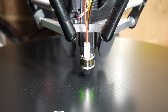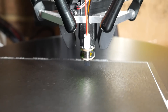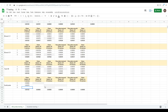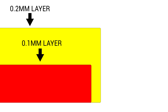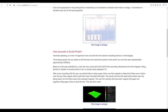With the probe temporarily installed on the SuperRacer, I was able to recreate the earlier testing I did on the ABL shootout video. This meant using Klipper's built-in repeatability test to probe over and over at a range of different speeds and on different surfaces. After collecting all of my data, I took the standard deviation from the output in the console and added it to my spreadsheet linked below. Just like the probes I previously tested, the accuracy and repeatability of the Euclid probe was extremely good. To put it in perspective, here's a scale diagram of 0.1 and 0.2mm layer heights, plus an average human hair, and then the standard deviation of the worst of these probes — so I can safely say accuracy and repeatability is not a concern.